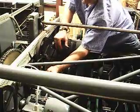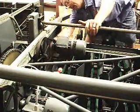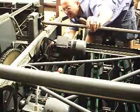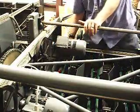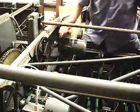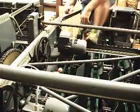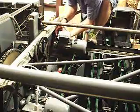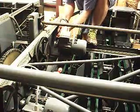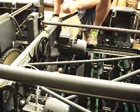I'll go ahead and put the belt on the little wheel and push it back. The reason I'm doing this is I want to see if I am aligned with the pulley wheel before I reattach it. It looks fairly well to me. Now that I know I've got the position I want to be in, I'm going to remove the belt one more time and tighten it in that position where it's at right now. Enough tension to make sure that set screw is tight, but not so much tension I break my set of Allen keys.